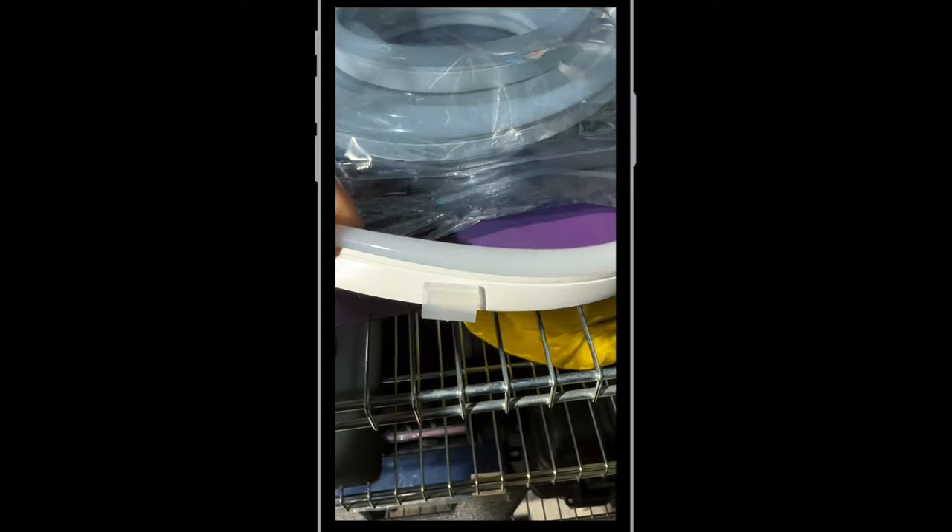The only real annoyance to me is the width of the strip, especially when using the supplied mounting brackets — there is a fair bit of girth there. So if you plan on using them around the edge of a desk, for example, you should bear that in mind. The smart aspect of these is powered by Tuya, and although I've only had one experience with Tuya in the past it has been a pleasant one, although the app is fairly basic looking and generic, which it has to be because it supports so many varied smart devices. Although these have an IP65 rating, this applies to the light strip only — the power adapter and more importantly the control box are not water resistant, so if you plan on using them outdoors these will need to be housed in a water resistant case. If you want to use these lights on a smart plug to completely cut the power to them, they will also remember their previous state when powered back on, which is just awesome. And remember, they're less than 30 quid.